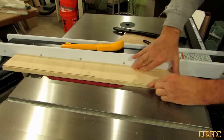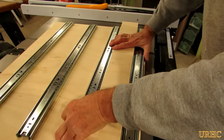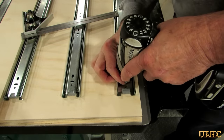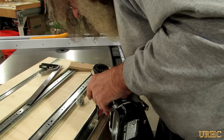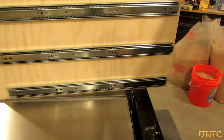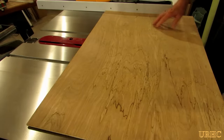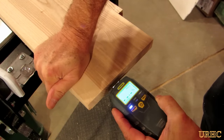This is some of that $29 sheet plywood from Home Depot that I bought a while ago — it seems to work out pretty good for projects like this. I cut a spacer piece to help with slide spacing and to make it easy to get everything lined up and mounted properly. Then I started mounting the slides to these two outer pieces of plywood using the screws provided, just to rough everything together and test it out before final assembly. I put them on one side and then on the opposite sheet also, and I needed to cut a back panel to hold the two sides in place.